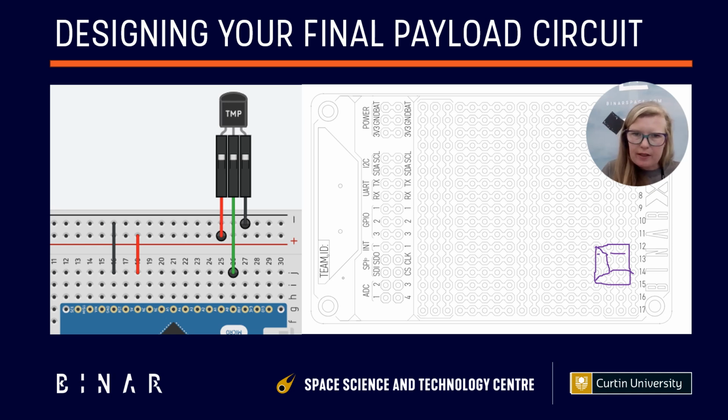But it's got the 3 pins on it, so we're just going to connect 1, 2, remember on different nodes, right? Because if you look, it's much easier to see than it is to do on the breadboards, because you can see the copper traces where things are connected. Anywhere that's connected by a continuous line of copper or just by an outline, those are electrically connected. So like on our breadboards, if we're using something like a temperature sensor, we have to go across different nodes, which we've done here. So don't go this way. But like on the breadboard, we do have ones running along here that you can use for power rails and to move the circuit flow around a little bit and keep your circuit nice and neat.